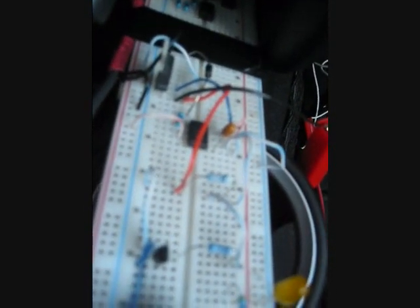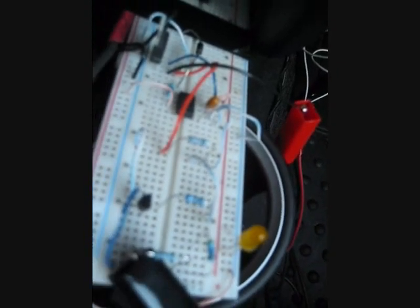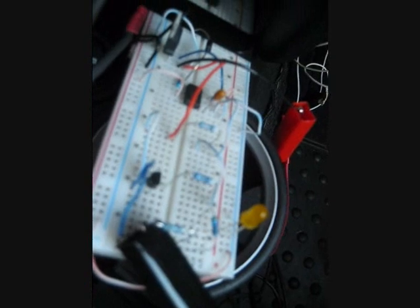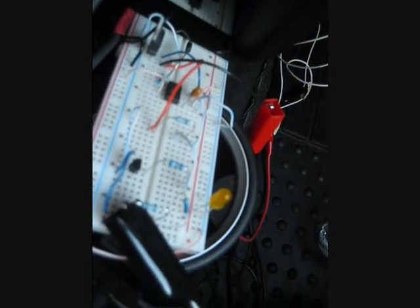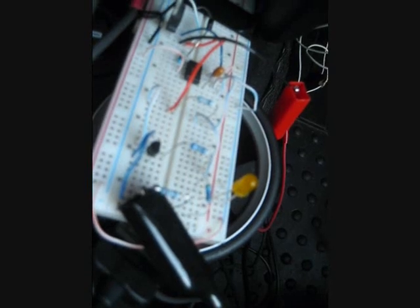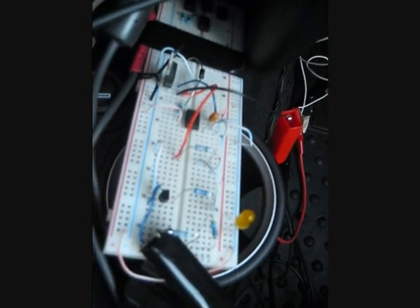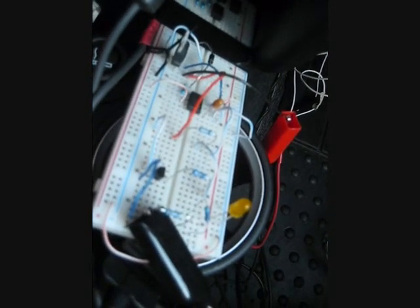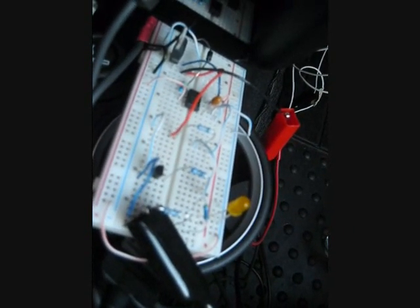That little chip that you see up there is an opto-isolator. The rest is all done with resistors and just one PNP transistor. I still need to do a little bit more testing on it. Some of the resistors do get a little bit hot, so I need to adjust some values. But other than that, the circuit seems to work just fine.